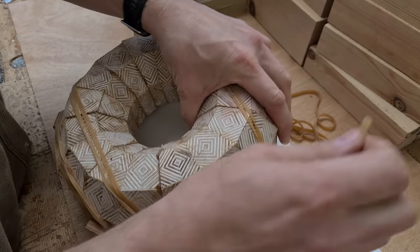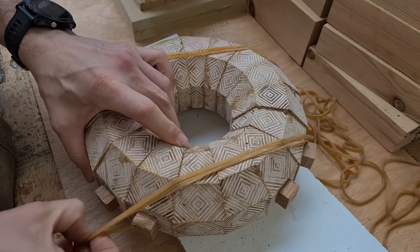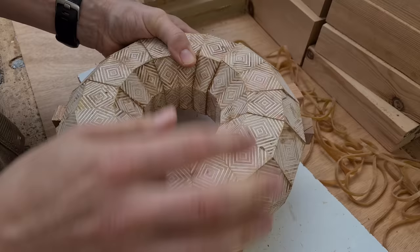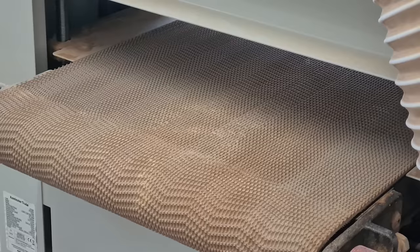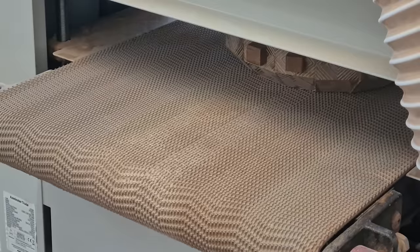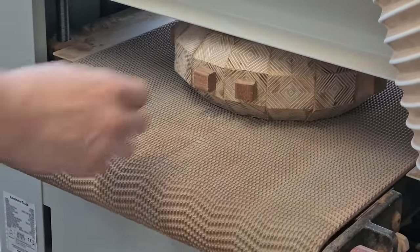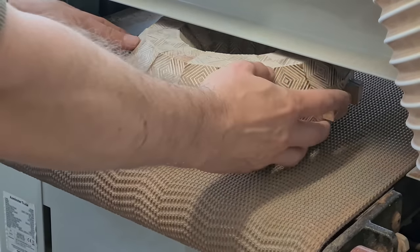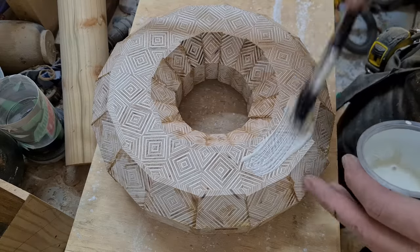I had put in a lot of effort into laying the groundwork for the basics needed for this project, but I do tend to prefer projects that have some real challenge about them. With the torus complete, I needed to flatten one side to glue it to a support board for the initial woodturning. I needed to make sure that the sanding done on top of the torus was at least parallel to the plane of the circumference, otherwise the pattern running around the circumference would be majorly out of alignment, and you wouldn't realize that until after you started the woodturning.